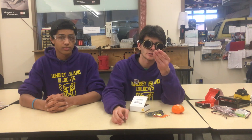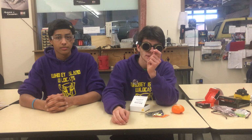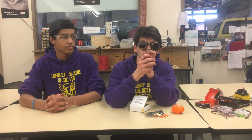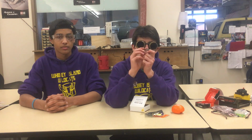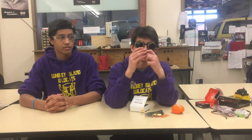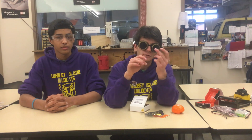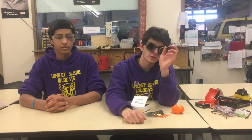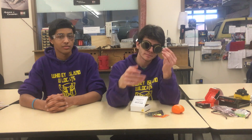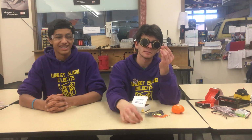Gyro sensors, essentially what they do is you turn it on, it's at 0, this is its 0,0 position if you have it on and it's flat when you first turn it on and get it calibrated. And then it tells you how much you're angled in whatever direction. So you could theoretically tape this to a chair, have it turned on, throw the chair, and it'll tell you how the chair spun. Please don't do that. Please.